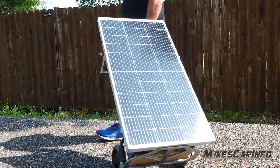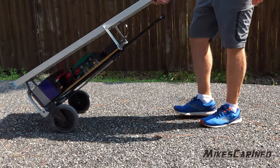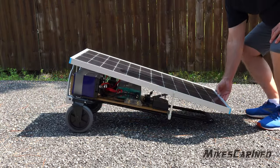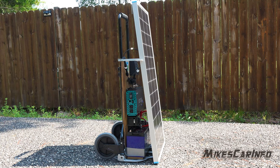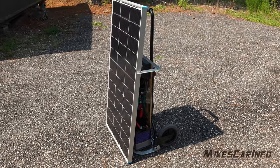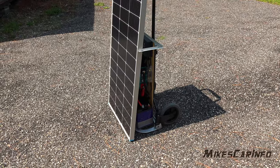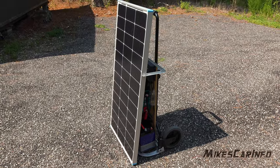Last night I slapped together a portable power bank that's solar powered, with the intention of powering my well pump. I live in the country, so I use a well pump for my water. When the power goes out, I don't have water pressure, and the pressure can drop to where I have to reprime the pump. This has the ability to temporarily plug in my well pump with a 1000 watt inverter and at least keep the pressure maintained.